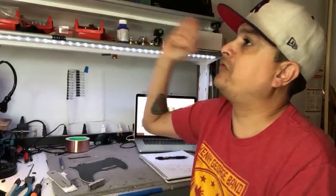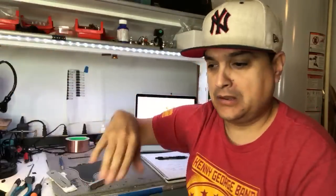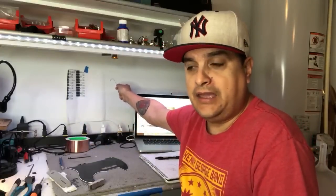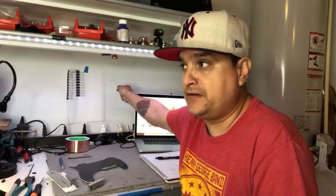The way a Faraday cage works, just so you know, is let's say we have voltage. We're going to miniaturize ourselves down. So let's say we're inside a guitar. I'm in a garage right now, but let's say we're inside a guitar control cavity, okay? And we've got foil over all these walls and the ceiling and the floor, and we've got voltage coming in from the outside. We will be shielded from that as long as the frequency is not too strong and not too high. So we can be shielded mostly from it. It will still come through a little bit, but we can mostly be shielded from it if we are not touching it. So we could literally come over here and now ground ourselves to the wall, and we will then conduct whatever interference is coming from the outside.